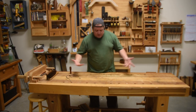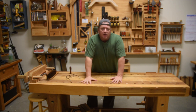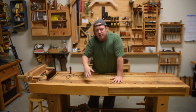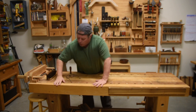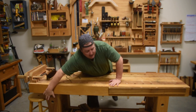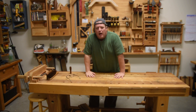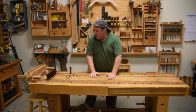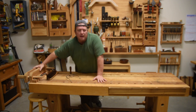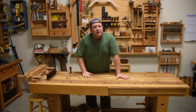As a point of reference, this is my workbench. It's made out of poplar and it's about 5 inches thick. I actually built 13 of these for a little woodworking school I had open for a while, and I just kept the smallest and worst one when I closed the school down. What's unique is all the legs are flush, and each leg has a spot for a leg vise so I could teach four people per bench. In use, I keep one leg vise here and what they call a moxon vise — really a small cheap twin screw made out of southern yellow pine on the end. The rest is dog holes and various ways I hold the work.